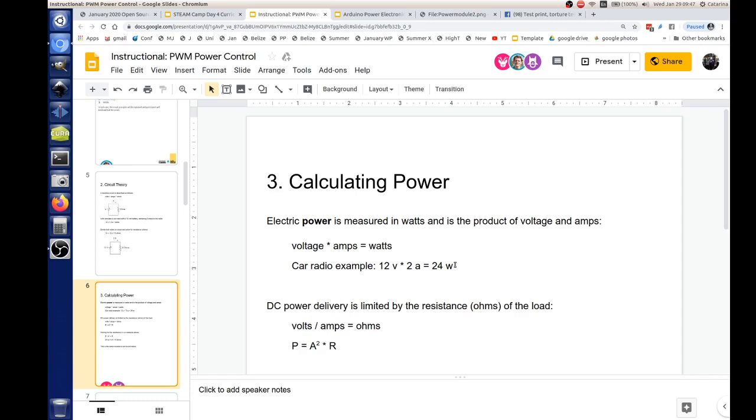So, for example, a kilowatt out of one 18650 battery means it's probably going to explode because it can't handle it. It'll be like 300 amps. That would be an explosion condition. But be clear about the distinction between the rate and the quantity. Two different things: power equals energy over time.